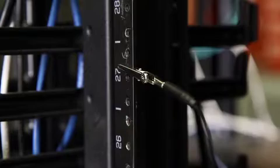Next, we'll install a power supply in the RPS. First, attach the ESD strap to your bare wrist and to the ESD point on the RPS, or if your entire rack is grounded, to a point on the rack.